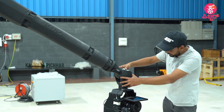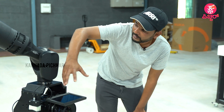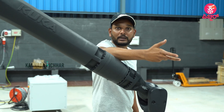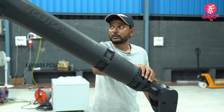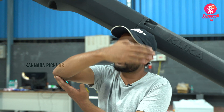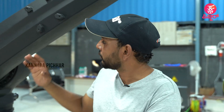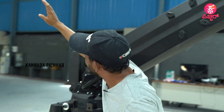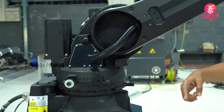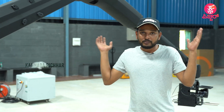This arm has 6 axes. The 6th axis handles pan left and pan right. The 5th axis handles tilt up and tilt down. The 4th axis is the arm and wrist, which does a complete 360-degree spin. Axis 3 is the elbow joint — with a complete stretch it can go up on axis 2 to a straight angle. Axis 1 is not full 360 degrees, but almost 270 degrees, giving us all-round flexibility.